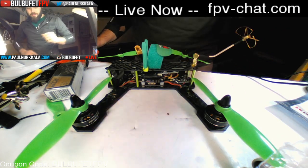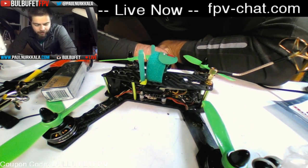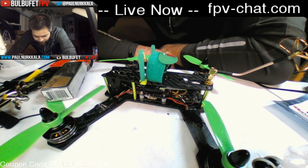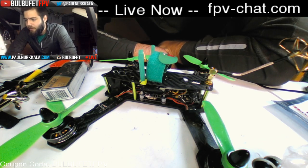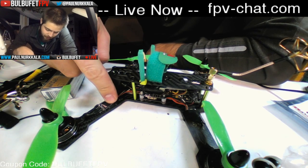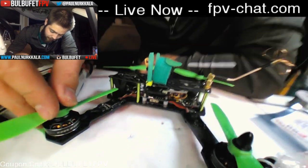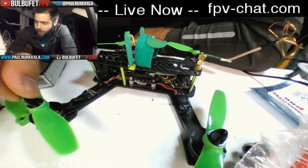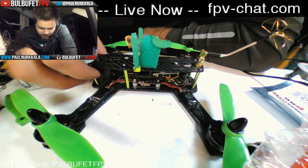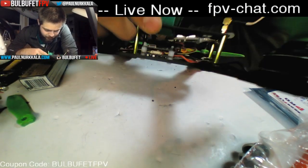So this is the Multirotor Mania MRM225. It fits 5.5-inch props, none of which I have right now, unfortunately. It's got Zeus 20-amp ESCs that come pre-flashed with all of the settings that you want. It's got the 2204 by 2300 KV mini Titans, an HS1177 camera, and an F1 flight controller for the Dragonfly 32, X4 RSB.